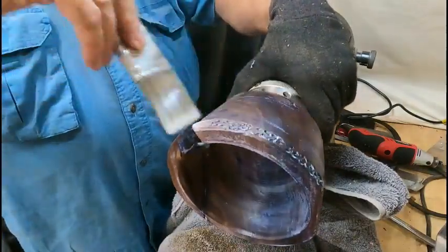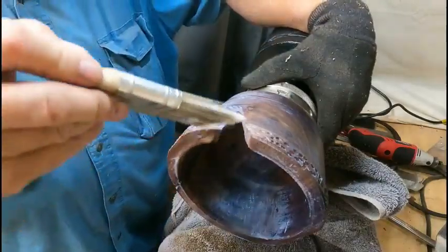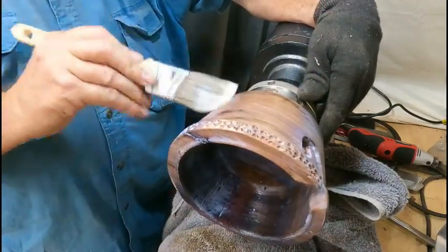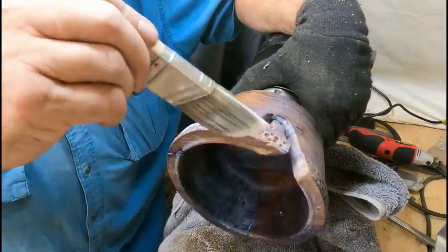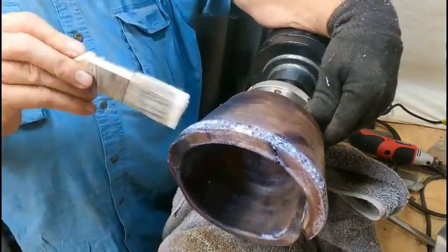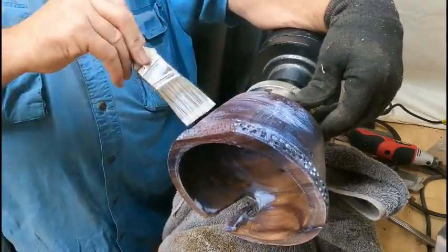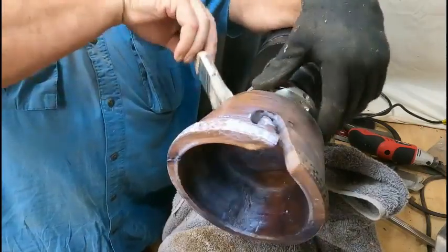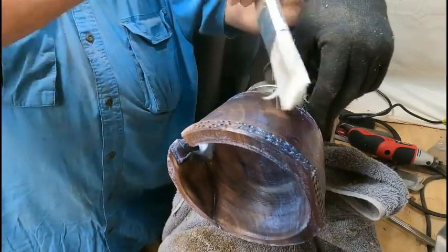All lumber, I don't care how dry you get it, it gets water in it. It collects water out of the moisture of the air. That's why you have to acclimate hardwood floors when you come to your house. And all wood does that. So if you seal it up really good, it's less susceptible to those conditions changing, and your material is more stable. So that's why I think it's good to take the time to get it sealed up good, and you'll end up with a better product in the long run.